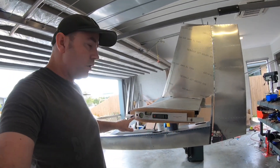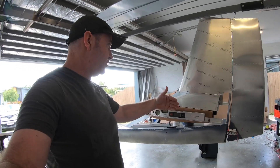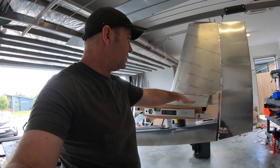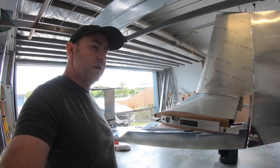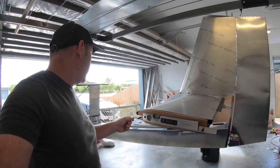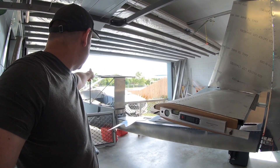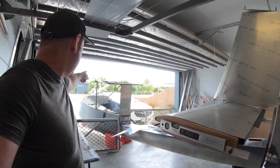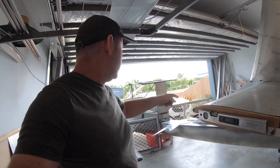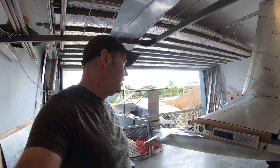I've picked the center line and clipped on a piece of aluminium angle so I can sit my level on it. That way we've got full adjustment and I know it's right through the center line of that rib. If I put a level on the top of here, as you can see there's a profile — a shape — that's going to give us a faulty reading, so doing it this way gives us a much better, very accurate reading. I also need to measure from this point back out to the wing pickup point, so that way I square the tail in relation to the wing.